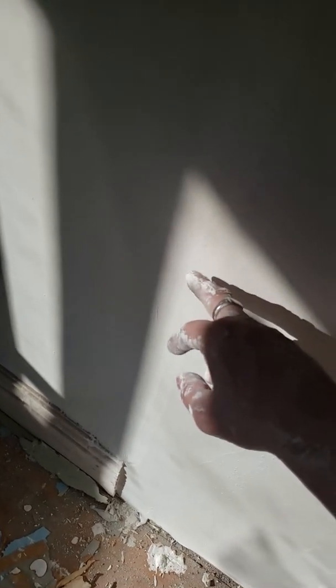It's all straight now — it skimmed out really well with all the straightening I did yesterday. There's only one questionable area: right here is where that piece of tape that ripped out was. I've loaded this whole wall and this whole wall up, so once it's almost completely dry and set up enough that I won't cut into it, I can just load that right up and it'll fill in and be true flat again. You already don't see any hump there — it's just a little dry spot where the tape was. There's a tiny bit of bleed-through here, so I'm thinking the homeowners on this one are going to have to grab a gallon of Kilz. That's the only thing that'll cover that bleed-through.